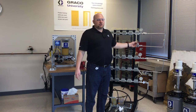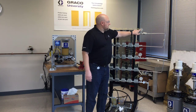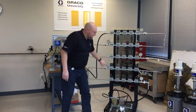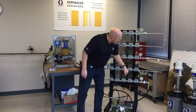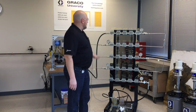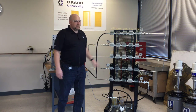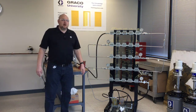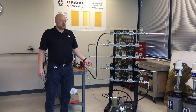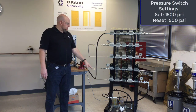If you've ever heard people talk about pressure drop or pressure loss, you can look at these gauges and see the differences: 2,500 psi, 2,000 psi, 1,500 psi, and about 1,000 psi. You can see through all this 3/8 tubing and 3/8 hoses that the pressure is dropping a few hundred psi through each stage. All of our injectors have fired but the pump is still pumping because the controller hadn't yet received the signal from the pressure switch.